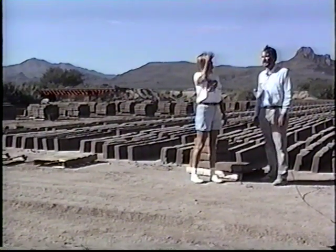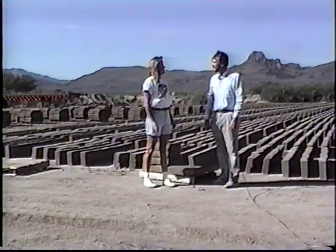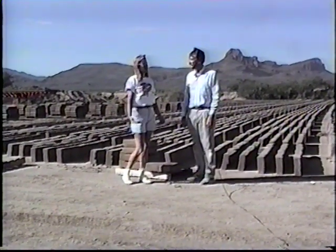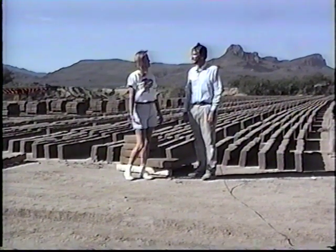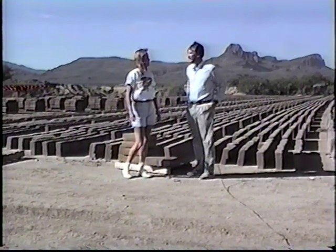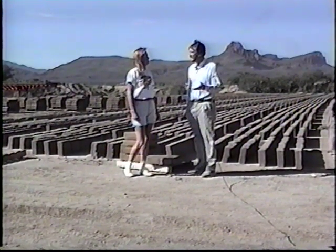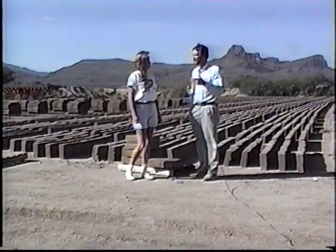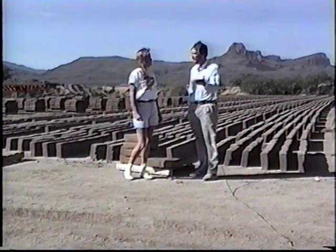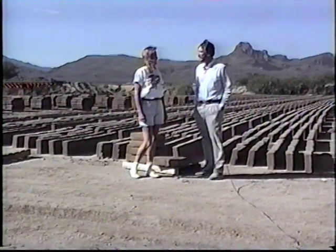I see. Now, is there a limitation as far as the northern climates where adobe would be used? Well, there's limitation in design. It's used in northern New Mexico, northern Arizona, but with snow, you obviously don't do a flat roof design. You would need an overhanging roof, pitched roof, for snow load because of snow problems and banking up against a building. Okay, so a limitation possibly would be on moisture content. If you have a lot of rain where it's moist all the time, then the adobe would not be a good product to use in those areas. Like you wouldn't take it to Illinois and build an adobe home. I wouldn't recommend it. Okay, so the southwestern areas are basically the best.